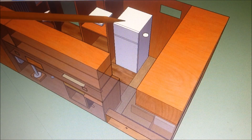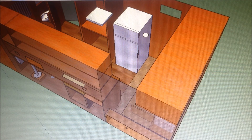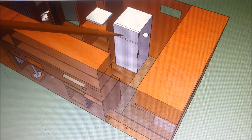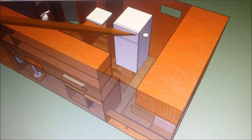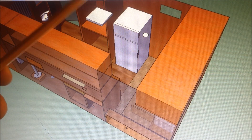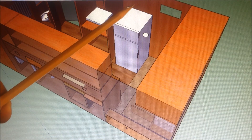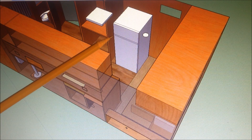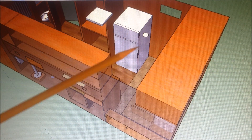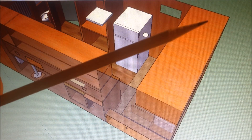Another change was where the refrigerator was going to be located. At first I was going to have it to the left, but I decided to change that for a couple of reasons. This is a propane refrigerator and it's very efficient — it's meant to be used inside, but it does let off a little bit of carbon monoxide. So I decided it would be better to have it more out in the open where you have this window and this skylight, and the heat comes from this side of the refrigerator, so you're going to have a 6-inch space right there. The second reason I moved it was because it's more over the wheels and axles of the trailer, and this is a 200-pound refrigerator so that's kind of important.